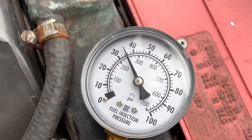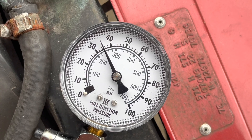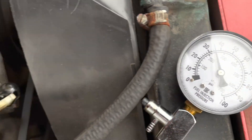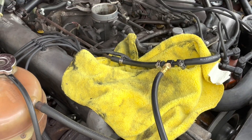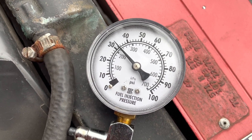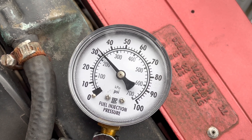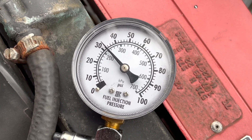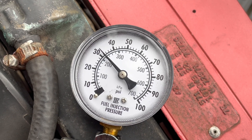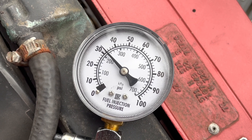As you can see, that's actually on the high side — 35 psi. We want to leave it for about an hour or so just to see how well it keeps pressure. Obviously it'll drop a little bit when you first switch off, but it shouldn't disappear completely — it should stay up for a good hour or so at least.